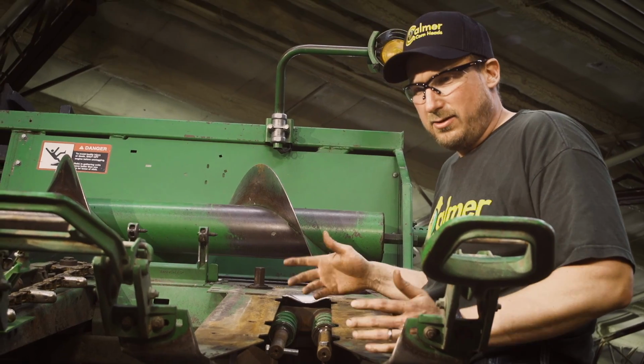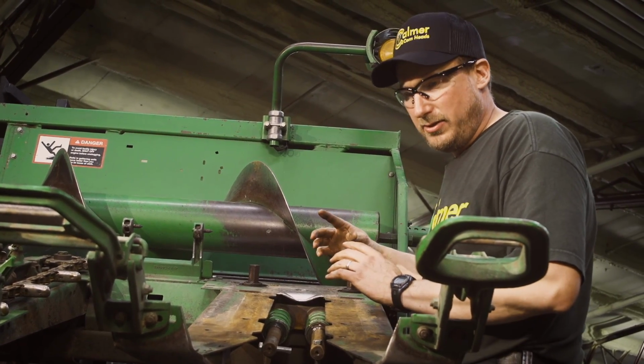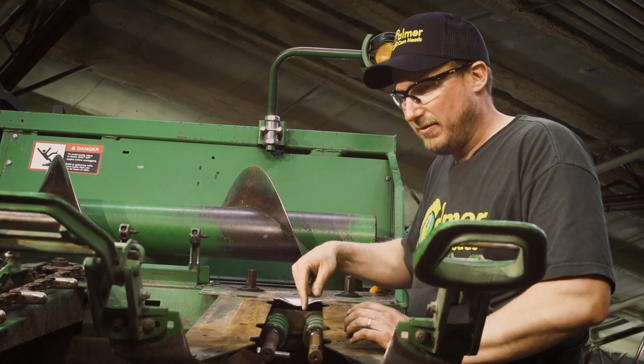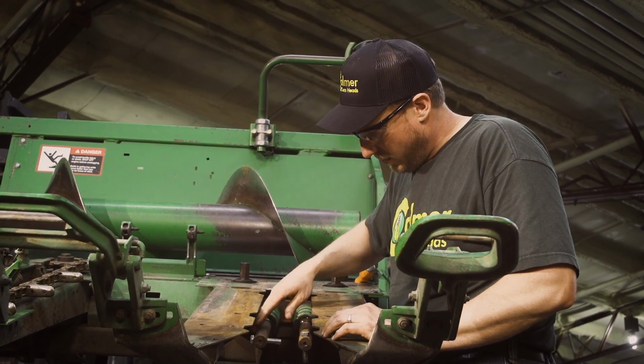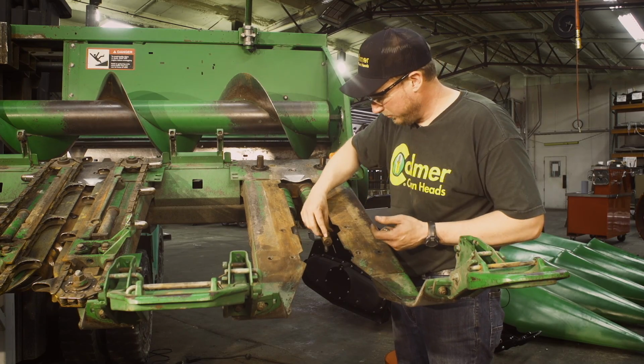If we are not, it's in our book. You have to remove this pinion housing, and basically you'll think it's one tooth off, but it's actually 180 degrees out. Any shaft, it doesn't matter which one. It's in our book though. This one looks to be spot on 90 degrees. So I will remove the 1/2-inch alignment bolts.